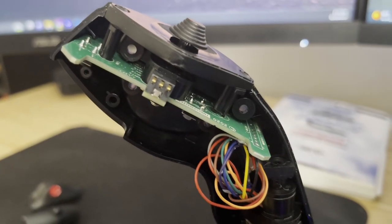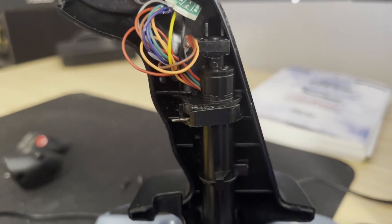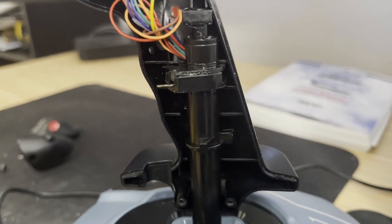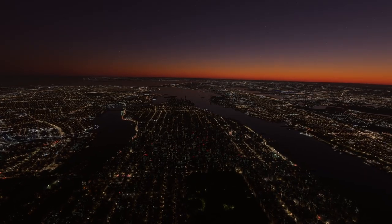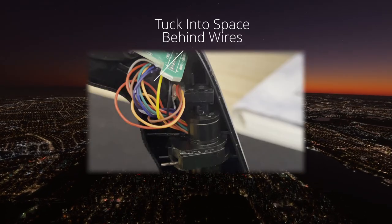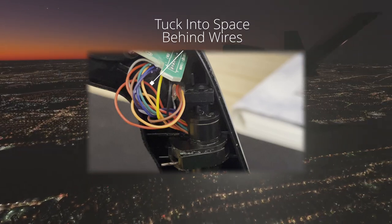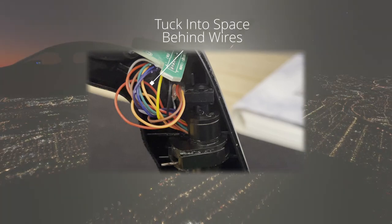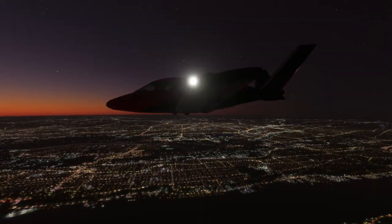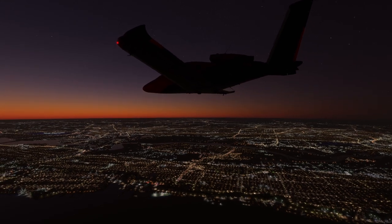Put the potentiometer back in, then the circuit board that was at the top of the joystick. And finally, if it fell out, put the access lock back in place at the bottom. After that, go ahead and start tucking the wires for the potentiometer back into the handle in a manner that prevents them from pushing against the potentiometer or causing any interference. Once you've done that, carefully put the handle back on, making sure not to pinch any wires, and reinsert the five screws you took out initially.